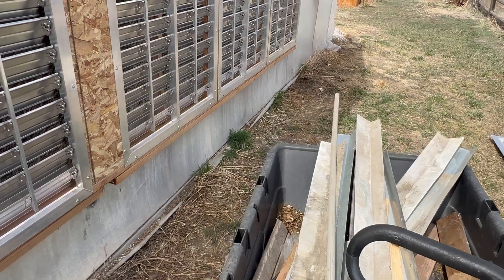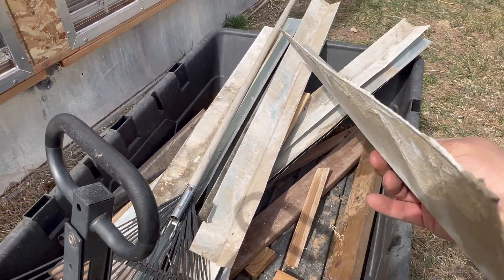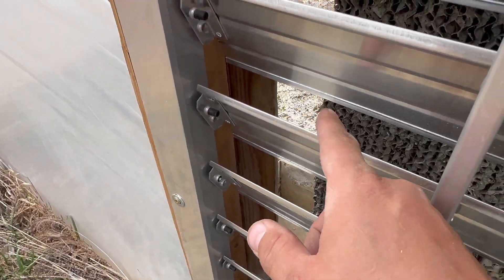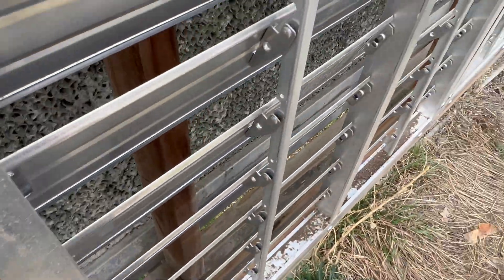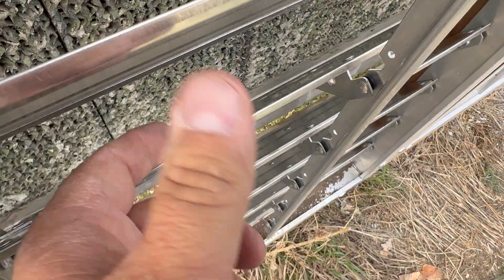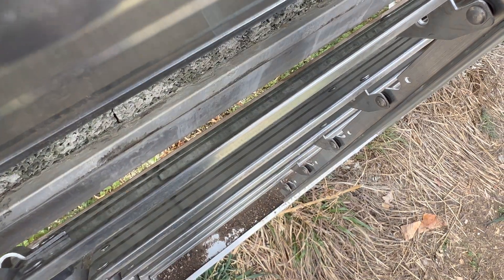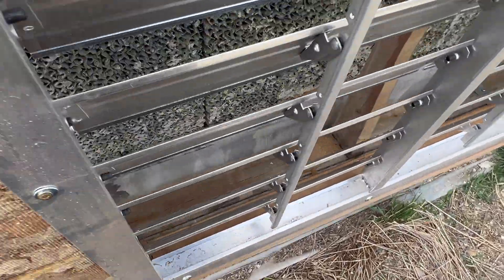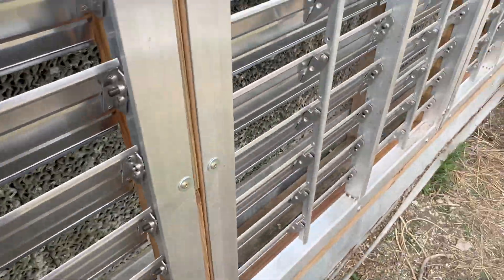This has been my project for the day. Previously I had the bug screen on here, and then I had flashing that I made and bent to close the gaps. But I can see inside the greenhouse right there — air is going through here. Air, like water, will go through the path of least resistance. So it's going through there and not through the wet wall, which is what I don't want. We can see the gap on the inside of the greenhouse right here — that's where that grass was jiggling. We don't want that. We want the air to go through these swamp cooler pads and not anywhere else.